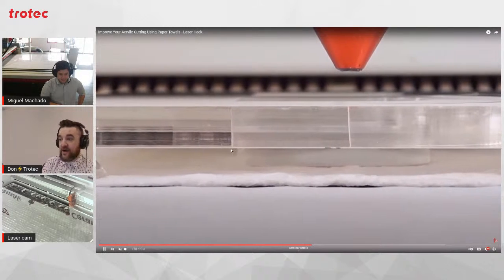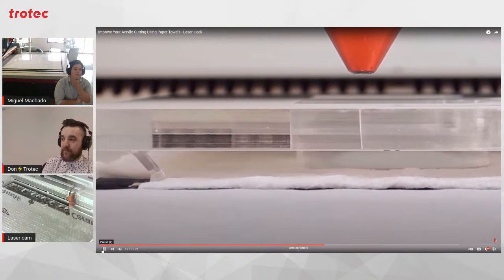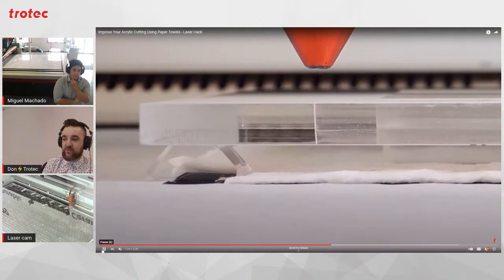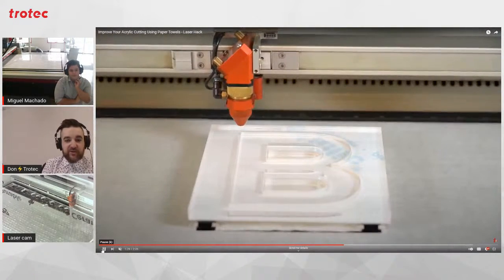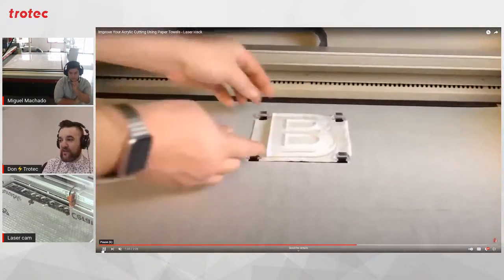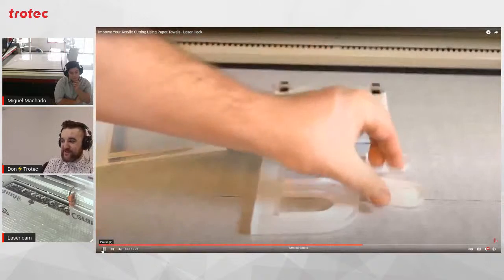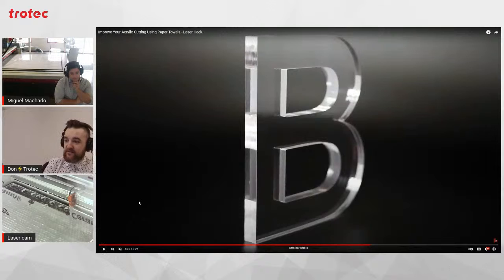Yep. I just wanted to mention the fact that you had the flaming. I know you were purposely trying to get the flaming, but the way that you got it is worth mentioning: just by focusing on the surface of the material, which people would naturally assume was a perfectly okay thing to do. So even though we did it on purpose to make sure that Miguel got the flare-ups and the flames that he wanted, someone who didn't know about the technique of focusing partway through the material would think it was perfectly normal. It's what you would usually do when you're cutting through something, right? So